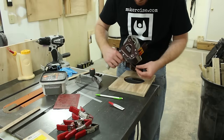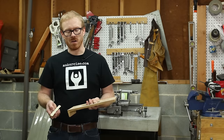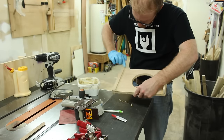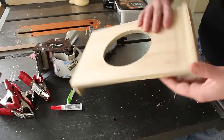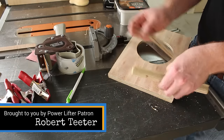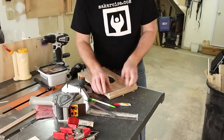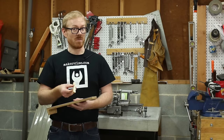This is known as a split pattern. If you're following along in the book, you'll know that there are quite a number of split patterns in this project. Having a two-part pattern makes the molding process easier. The pattern is easier to mold because you don't have to hold an awkward pattern level during molding. You can just put the flat surface of one of the patterns down on the molding board, ram up the first part of the flask, roll it, install the second half of the pattern, and then ram up the other half of the flask. Then you can separate and remove the pattern as a whole. That is the way I built this pattern.